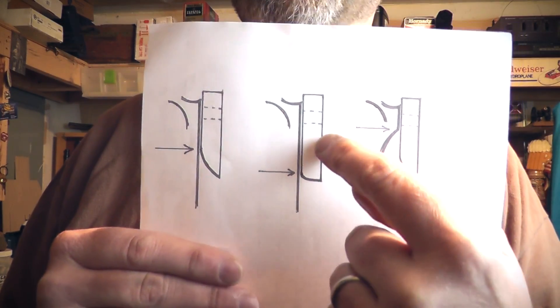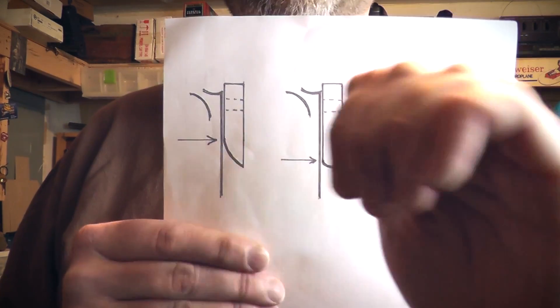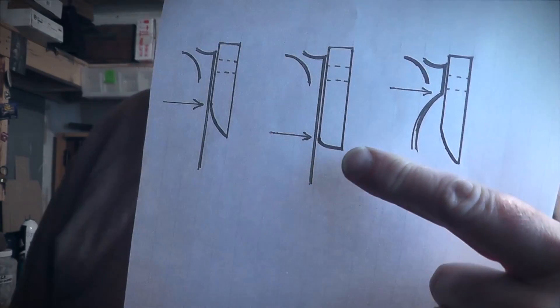With our .45 Super we put a firing pin stop with a much smaller radius on the heel, which lowers the contact point between the hammer face and the firing pin stop. Look how much shorter that lever is — we've cut probably 25% or more off the length, decreasing the leverage the slide has in cocking the hammer. If you put the square or reduced-radius firing pin stop on there and increase the mainspring rating, you really can retard this movement. It makes it hard to rack the slide — like pushing a door open near the hinge instead of at the doorknob.